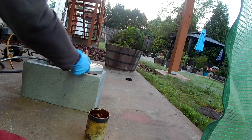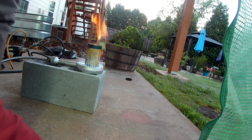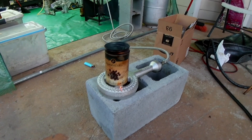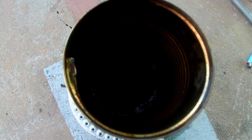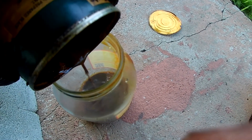After that I have pure pyrolysis gas coming out here to heat this oil up — trying to keep this a closed cycle. As soon as I put the can on there it almost instantly combusted. I know it's because volatile vapors evaporate and those vapors catch on fire, but it happened so quick it caught me off guard. I thought it was too hot, so I turned the temperature down a lot and put a lid over it to keep some of that stuff in. After about 20 minutes at a relatively low temperature, it just looked like boiling black oil. I poured it out into a jar and, not really to my surprise, it was just as dark — no difference.